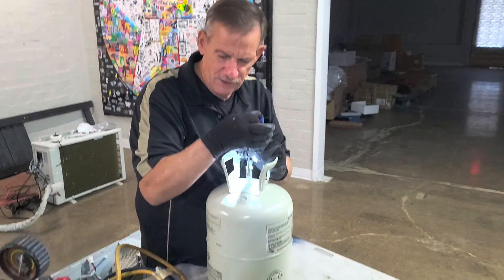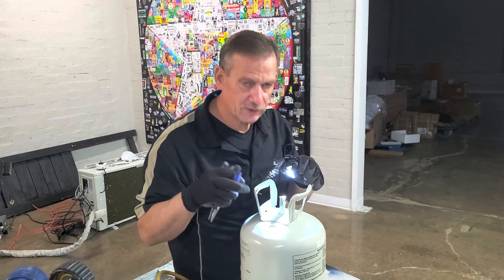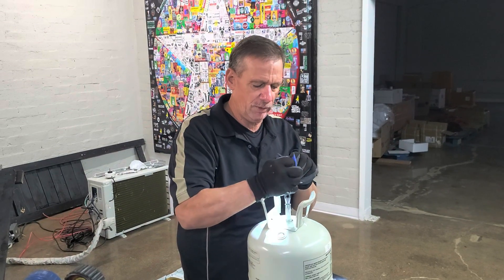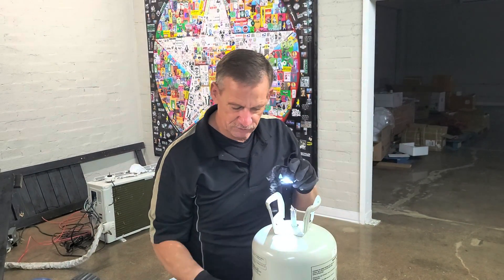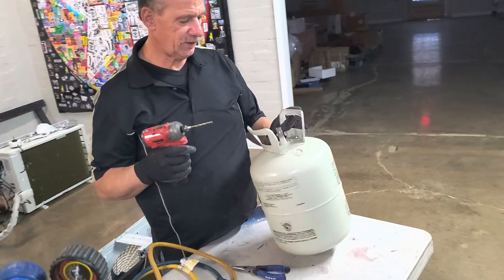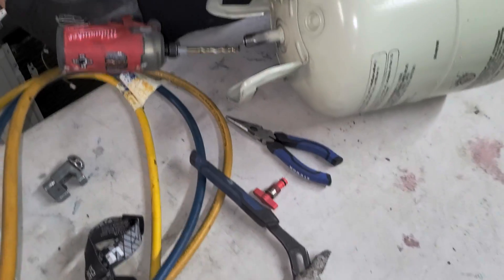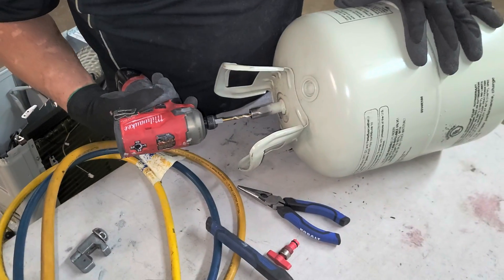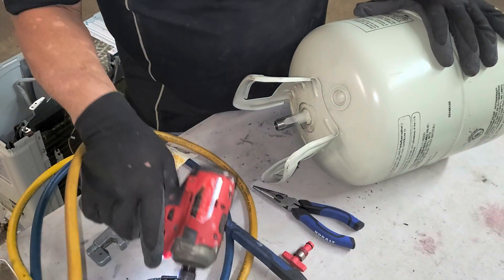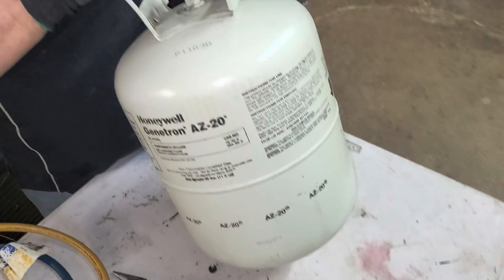This isn't really designed as a permanent solution for a recovery tank — it's for when you're in a pinch. You've got to know what you're doing. Now, we've got our drill. We're going to punch a hole through that flapper. Important: lay the tank on its side to prevent shavings from dropping down in. It's just plastic — drill a hole, that quick, that easy. Tap it out. No more flapper — and the flapper actually came out.